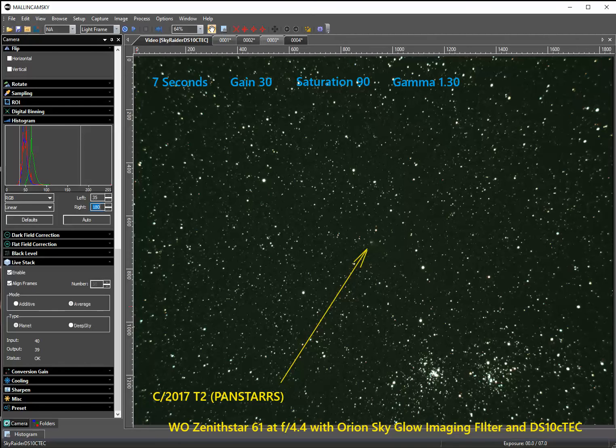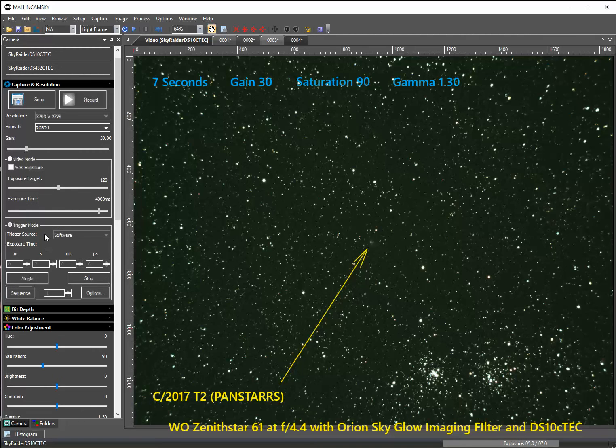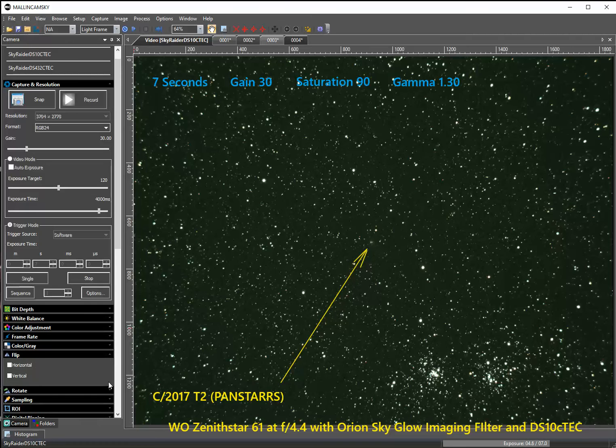Yeah, Jeff, I got my Max HD guider back from Anthony on Thursday, and he said it's working perfectly now. He said it could have been that he made the clamp blocks from one production run, and he did the base plate from a different production run, and the tolerances are so tight that it's possible that's what ended up messing up the fit. And then when you throw the anodizing on top of it, it made it really too tight.